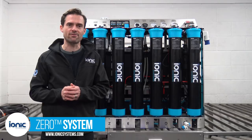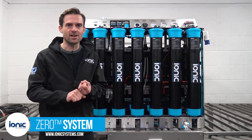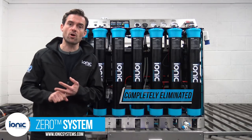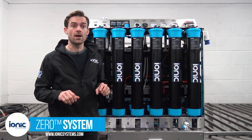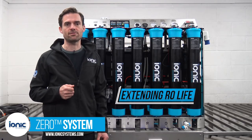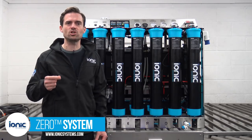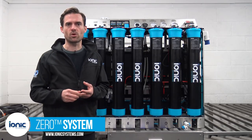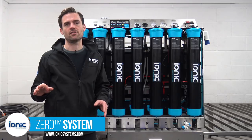There are two principal benefits. Firstly, bacteria such as Legionella are completely eliminated, and secondly, biofilm is inhibited from forming on the RO membrane, maintaining day one performance and considerably extending RO life. Dealing with organics reduces running costs, maintains RO performance, guarantees water quality and eliminates the risk of Legionella.